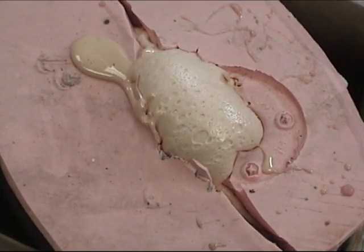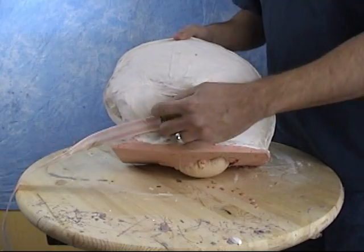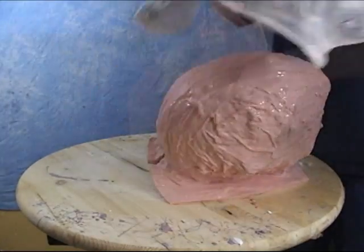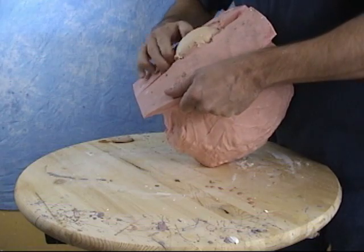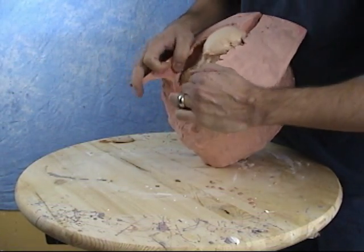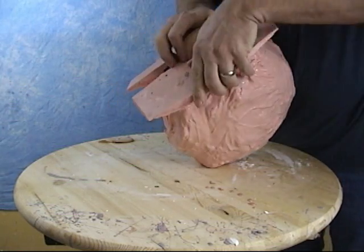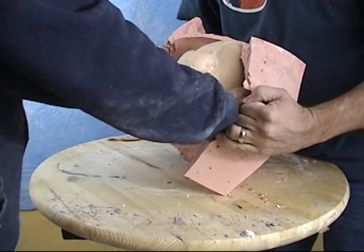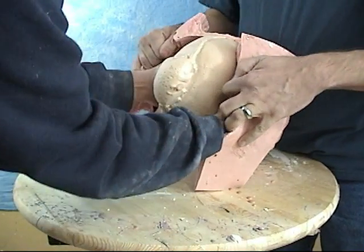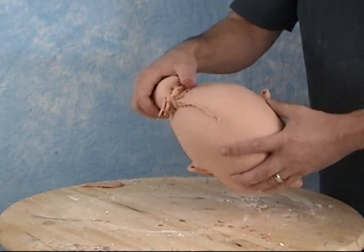After about 30 minutes your foam will be cured enough to demold — keep in mind that cure time depends on a fairly warm work environment. Once you open the silicone mold, it's a one-piece mold so it requires a little help to get the part out. Watch out for thin spots like the ears — make sure those pop loose first, then pull the head right out of the mold. Since this is an open-mouth cast, it's a little tricky, but once out you just cut off the small pour sprue and the part is ready to paint.